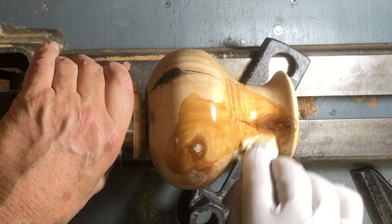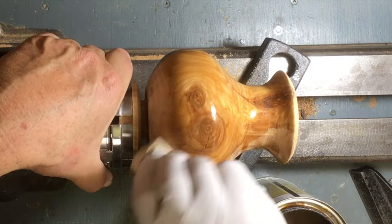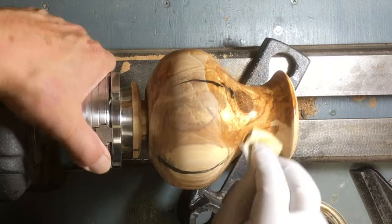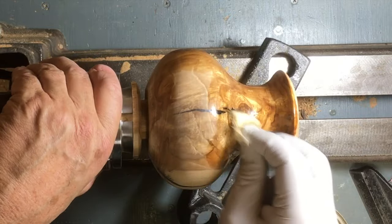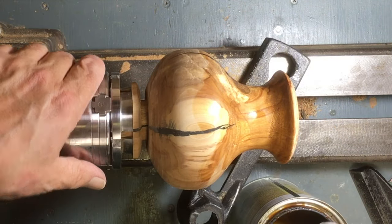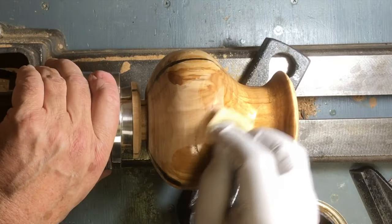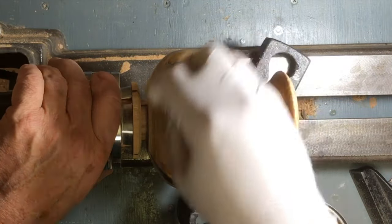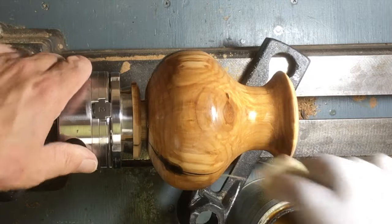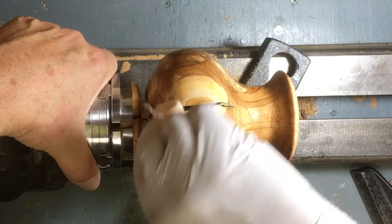Here I'm putting a coat of shellac on it — man, did this wood come to life with that shellac finish. What I was trying to do here is solidify the wood, almost glue it together. I've read that for end-grain tear-out, it's nice to get a thick coat of shellac or sanding sealer. So I slathered on shellac, sanded it pretty much all the way off, put it on a second time, and sanded it all the way off again with 220 grit paper.